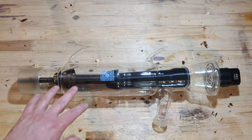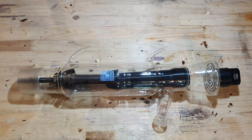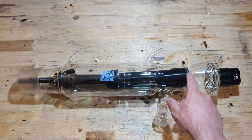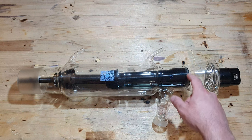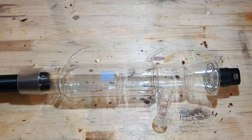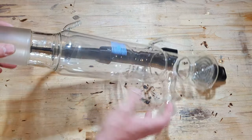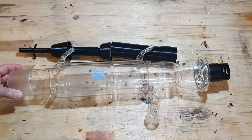because I thought maybe it is possible to make it out of metal, but I haven't gotten to do it, and I'm a little bit worried that the different thermal expansion coefficients between the metal and the glass could cause the glass to crack right here. If you have any idea how to rebuild this pump, or if you have any ideas what to do with this beautiful pump, it looked absolutely horrible when I got it, let me know in the comments.